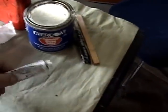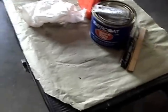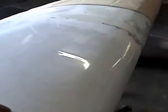I use the blue cream hardener with it, so I kind of spotted it. Very little hardener goes into the thing. It kicks pretty quick. So if you want any work life, you just mix just a little bit in, mix it up, and then let the stuff kick off. If you get too much in it, that sucker will kick in about 2 minutes. So anyway. More later.